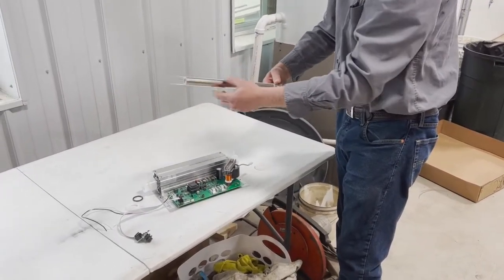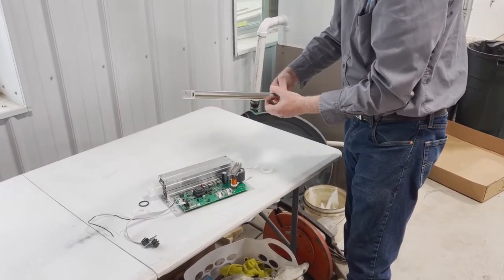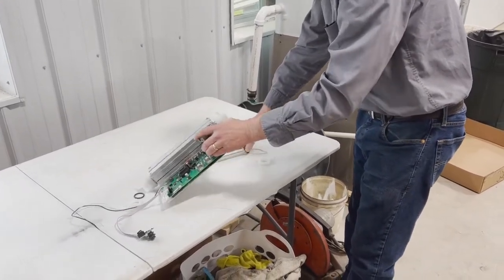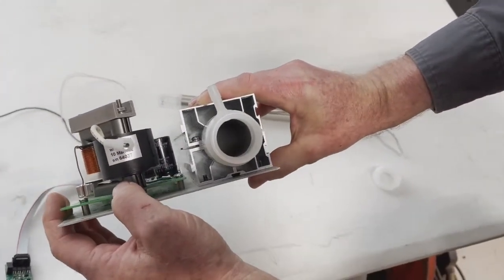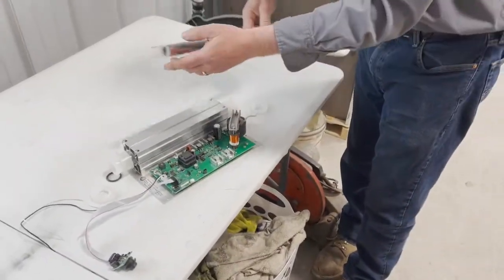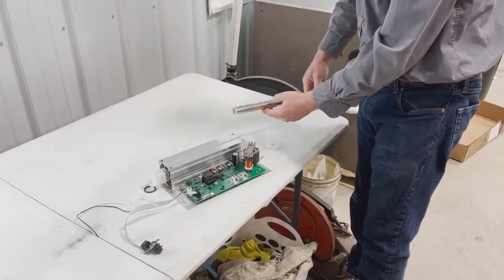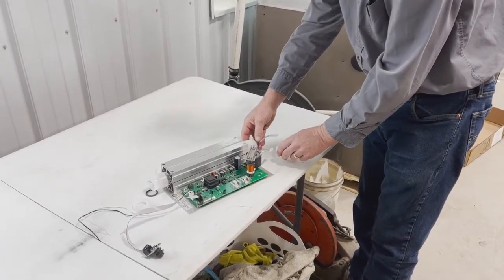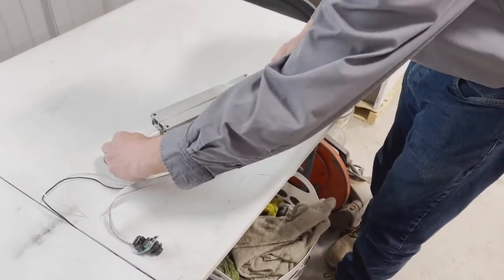The oxygen gas is actually flowing around the outside between the dielectric and the housing. On the inside it's just a stainless steel housing. If the dielectric gets cracked, these can be easily replaced. If water gets into the ozone generator, taking it apart like this lets you clean it up and dry it out, then put it right back together. When reassembling, leave just a little bit of it sticking out on either end.